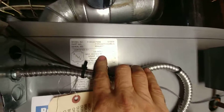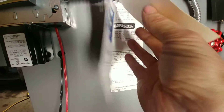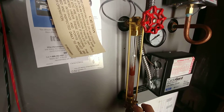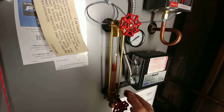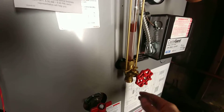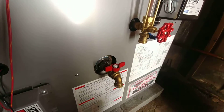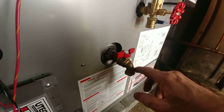This is U.S. Boiler Company's Force. It has the typical U.S. Boiler Company specified sight glass with excellent brass protection rods and proper slip ring washer. We've added a blow-down here, and the other thing we've added is a proper drain valve. Usually these come with a really cheesy cheap drain valve, so we throw those into the scrap bin and put on this Legend valve here.